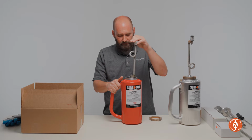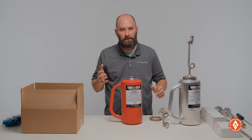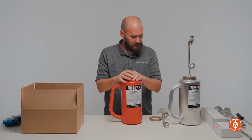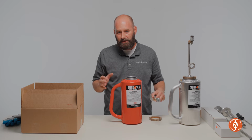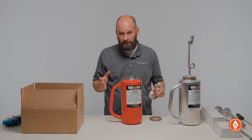When you have that diesel fuel and gasoline mixture sitting in your tank for several months in all kinds of different environments, hot, cold, that fuel can do some weird things. It can gel and it can release sediment into the bottom of your tank. And it just creates a headache, so it's just better to store it dry long term. If you're going to store it for several months, go ahead and store it dry.